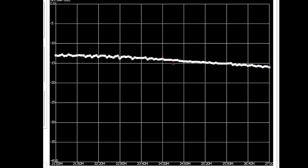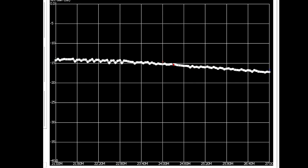Now that's 9 beads. Sweep again — let's call it 15 dB. I'm going to push the beads together just to make sure, and they are — they're pretty tight, hard to slide because they're tight on the coax. I've pushed them together. One more bead to see what happens — that's 10 beads. In the past, this was the point of diminishing returns where I would stop.